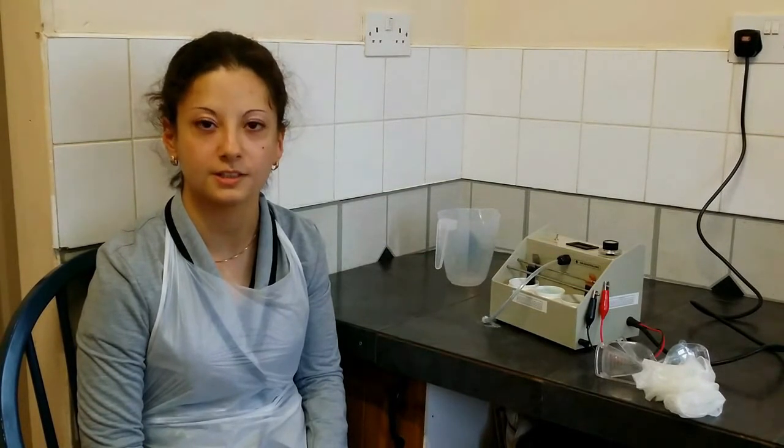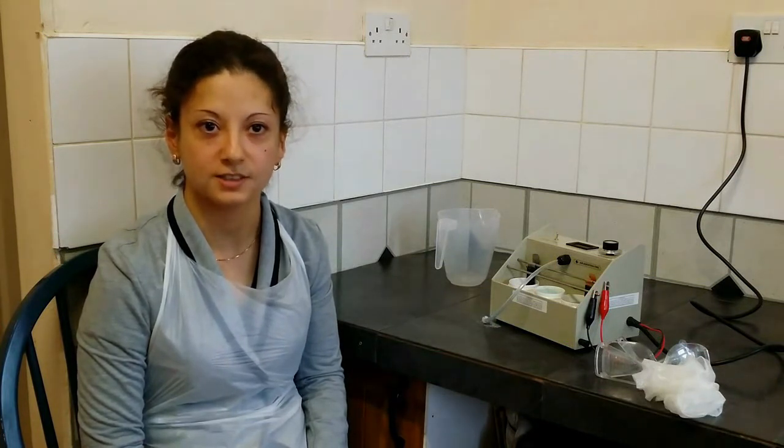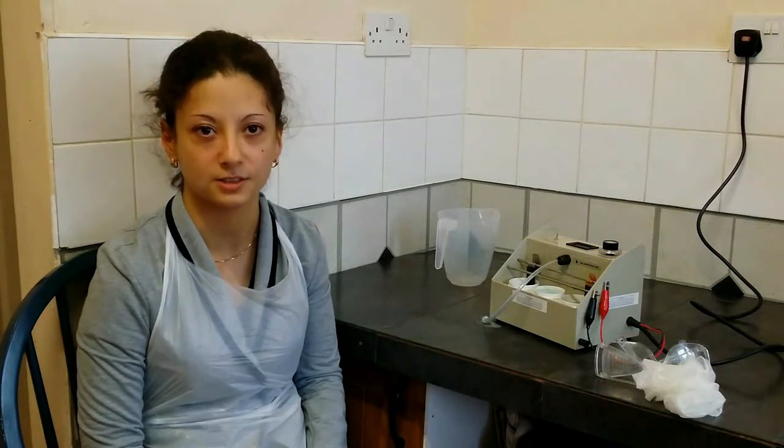Also, it is worth noting that it is advisable to electroplate in an open air or in a well-ventilated room. This is due to the fact that some processes might be producing harmful gases. All in all, please make sure that every time you are electroplating, you follow health and safety rules. This machine is tested before it is dispatched to you, and we can confirm the high quality of all its components. It can only be damaged in a case when you use current which is too high, or your object is too close to the anode, and this could lead to a short circuit. To avoid this problem, please ensure that when you put your object into the tank with the solution, you first turn the power regulator anti-clockwise to the left furthermost position, so that there is no power supply.